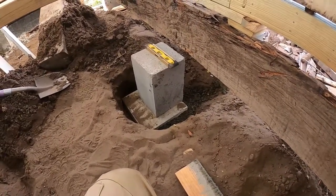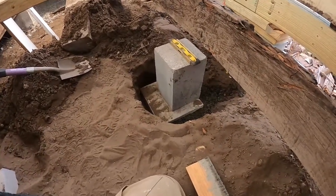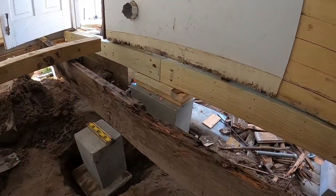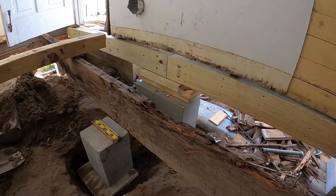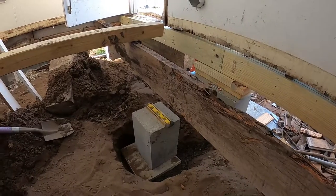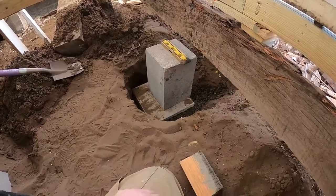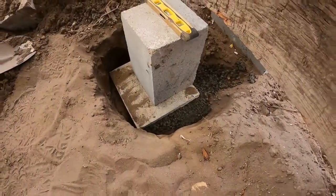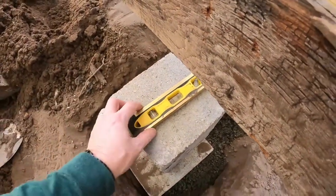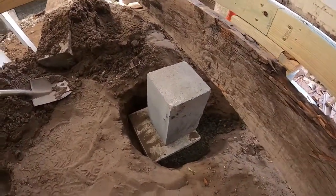That's about it for today. I've got the post in place, the beam is fully up. I did pull the screw jacks down, so that wall is fully sitting on the new beam now — the whole thing has no support at all other than the blocks. I've got this new block in — I just poured some high-strength concrete under that base, got it all leveled up. It's slightly high on this side but nothing that we can't block for.